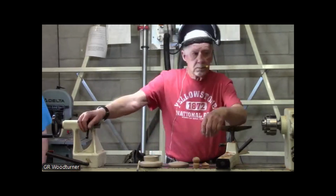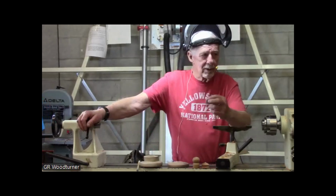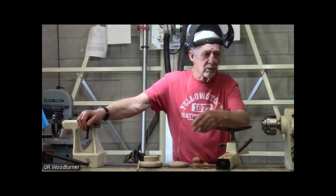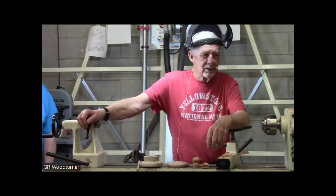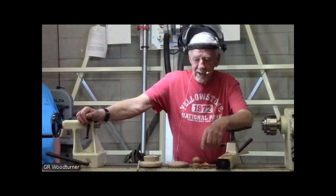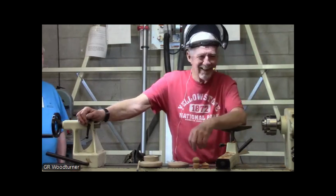Where did you get your bearings? I bought them on Amazon. All I did is I looked up the inside diameter for the shaft, and I didn't care what the outside was because I was going to make something to hold it. And same place with the magnet. You get like 50 magnets, a 1/4" or 3/8 of an inch, for like $6. So this one actually has 2 in the bottom of it, and I glued those in so that they didn't pull the bearing and everything out with them.